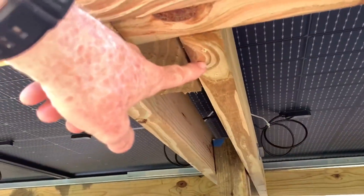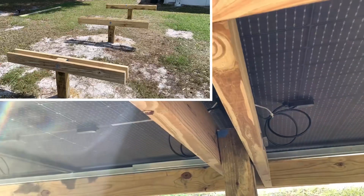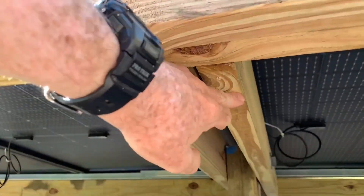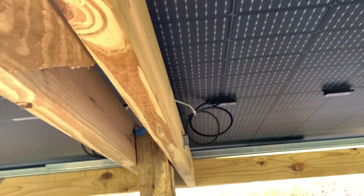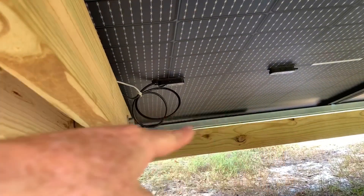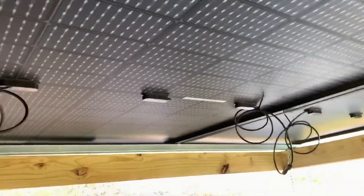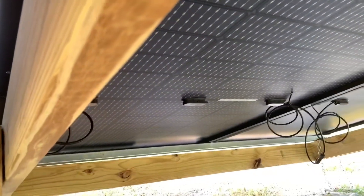These cross sections that tilt are only 64 inches long because of the size of our panels — we were only putting four on here. At first I thought I might need cross bracing like in the reference video, but that array was a lot larger. Because ours is smaller, we didn't need that extra support. The super strut running across here, which is also bolted in, gives extra crosswise strength. For this build we used four pieces of super strut — one on top and one on bottom for the first two panels, and another piece on top and bottom for the other two.